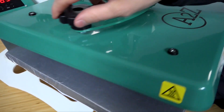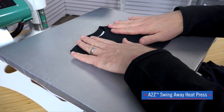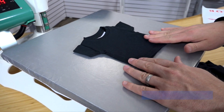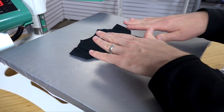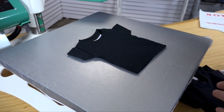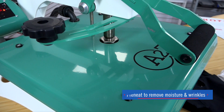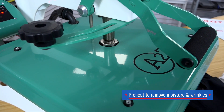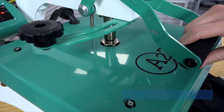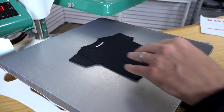We'll be working today on our A to Z swing away heat press — this is a newer press and one of our most popular machines for startup companies. I'm going to position my shirt; you could do multiples at a time, but for this example I'm just pressing one. I'll start with the preheat. It's very important to preheat to prepare the shirt to receive the transfer — this removes moisture and wrinkles and warms the shirt so the adhesive flows more nicely. A few seconds is fine for that step.